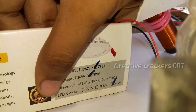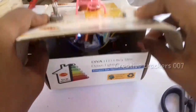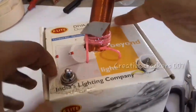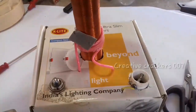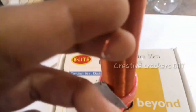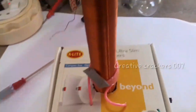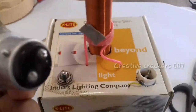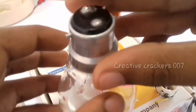The next part is to close it, and we have attached the 9 volt battery to it — sorry I did not take video of that. So now we are going to test how it works. Before testing, something looks missing. Yes, the bulb is missing. Now I'm going to solder the bulb to the secondary coil — just solder it to one of the terminals.